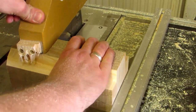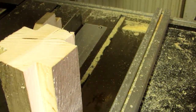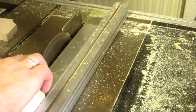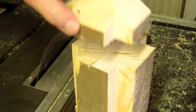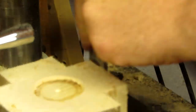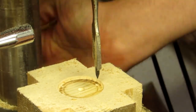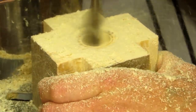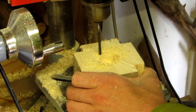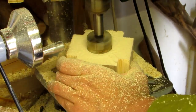Now we have to make room for the tea light. This is done by cutting away everything that should not be there — cut off the roof and the base and discard the middle. On my table saw that takes two cuts, and I use my fence to make them, but a miter saw would work well too. The bottom needs a tea light-sized hole, best made with a sharp forstner bit or a spade bit of the appropriate size. I did not have a spade bit large enough, and my forstner bit was not sharp either, so I worked my way to the hole using a small spade bit and a small brad point bit to remove material. Yes, I know how to sharpen them, but I think I overheated mine. It worked, did it not?